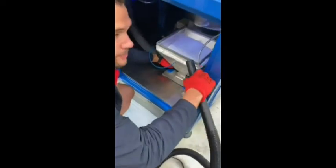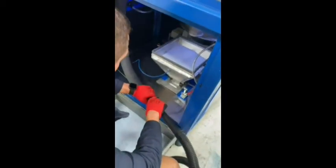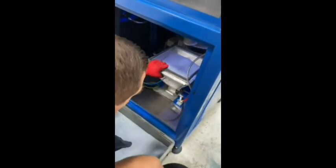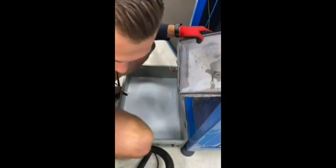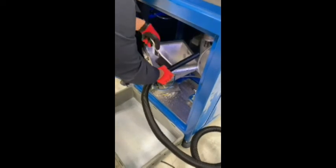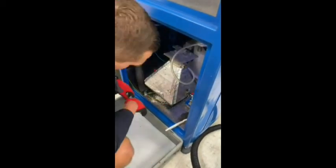When cleaning the throw wheel, disconnect the media tube and vacuum any excess media from the throw wheel. After that, remove the hopper and empty the media out into a tray. Clean any excess media left inside the hopper by using a vacuum. Sometimes a brush is needed to agitate the media from the sides of the hopper. Once it is clean, place the hopper upside down to allow the moisture to drop out and prevent it from being damp for the following shift.